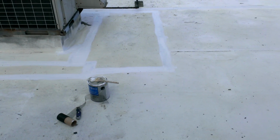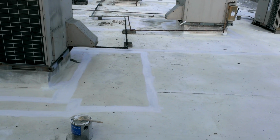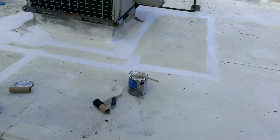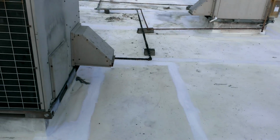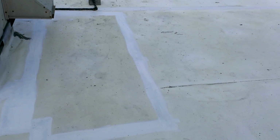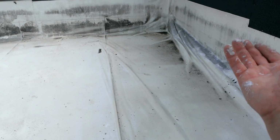You can find products that are really expensive, for many different applications, purposes, and temperatures. So first understand what type of material you have on your roof. After that, find a compatible patching material that will allow the contraction and expansion of these things. Remember that not everything will react the same way, especially in this material. See the wrinkles over here and all the stuff. It has to be elastic enough and strong enough.